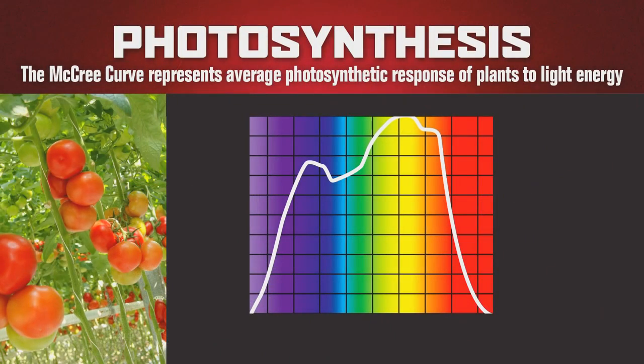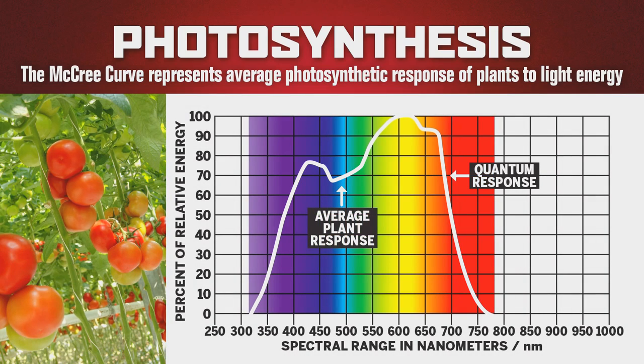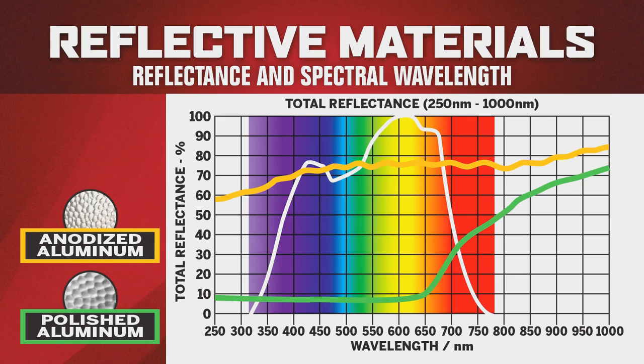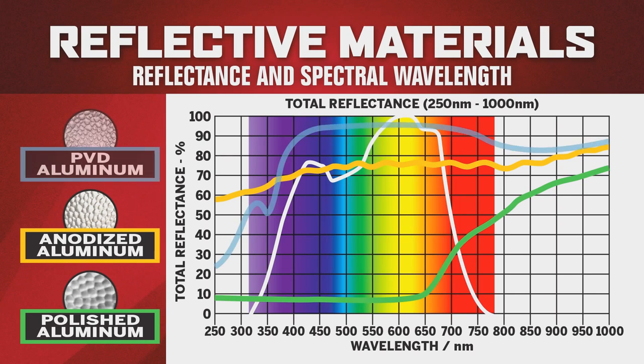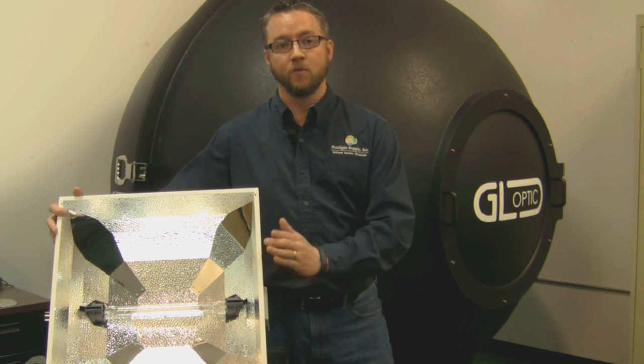Now it's not just the reflective percentages that we're concerned with — we must look at the spectral wavelength the reflectivity is happening at. As you see on this chart, the low-grade Chinese oxide material has very poor reflective properties in certain spectral ranges. The anodized aluminum material has a wavy, inconsistent pattern with peaks and valleys across the spectral wavelengths. Then we have the PVD material with a very even reflectance across the full spectral range. Ideally, an even and uniform reflectivity scale with regards to the nanometer wavelength is what we're after. When I refer to reflectance, it's important to note that if the light is not reflected, its energy is absorbed in the form of heat. So a lower reflectance hood will absorb and then radiate more heat into your growing environment than a highly efficient, highly reflective hood that will direct more light onto your target garden.